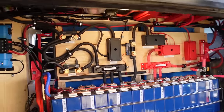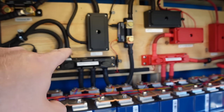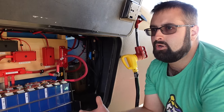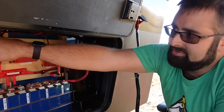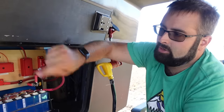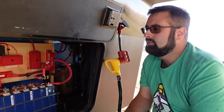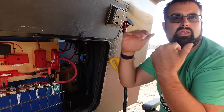Because I have two 48-volt batteries, I have a shunt for each of them so I know what's happening on each particular battery — lower versus upper. You can't see the shunt for the upper one; it's mounted up above. I'm using the Victron Cerbo GX along with their VRM dashboard to track all this data. The Cerbo platform requires a single shunt to show state of charge, so I've added a combined 48-volt shunt. The upper and lower shunts feed into the combined, and then out to the system — so the combined gives my full state of charge in the dashboard.